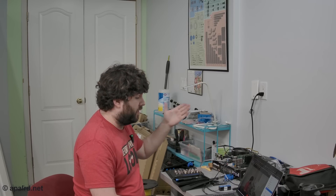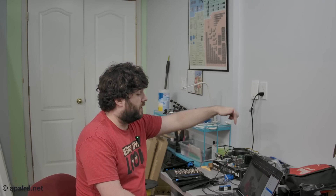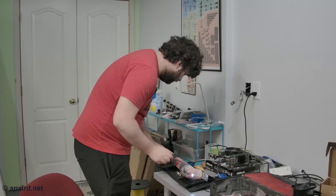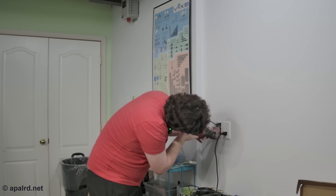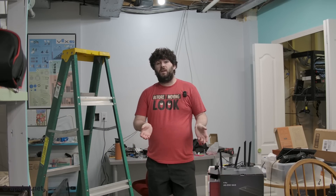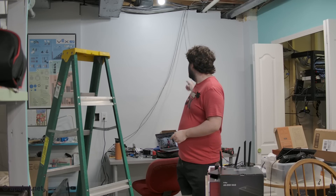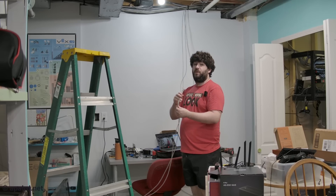So here's a view you guys probably don't see a lot. Here's the box PC, and I've got this guy over here on the wall — it's Cat5. Usually I use it to plug in my camera, but I'm going to instead use this for networking on the bench so I don't have a cable dangling out and running out of the door. However I probably need more than one, so I'm going to run a second cable here, an extra one for my camera over there, and two fibers — so I can have fiber for this, two ethernet for the bench, and one extra fiber for the bench. I got a bonus coax too, not that I need coax. Right about here where the ladder is, is where the camera usually sits, and I've just been running an ethernet cable across the floor for the camera. The camera needs Power over Ethernet — it's PoE powered. So I'm running another cable up to the ceiling and down the wall over there for the camera. I accidentally cut the cable that was already there, so I'm running two cables now — just two new ones, not a big deal.